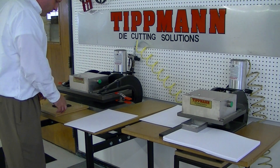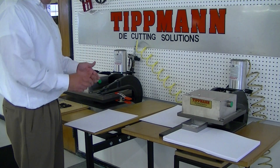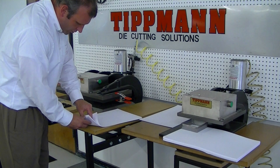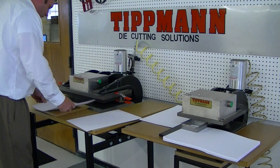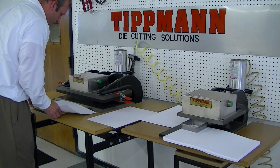The way this would work, you would design the die with the cavities to cut out from your printed material. I'm just going to cut about three or four sheets — you actually get a pretty decent cut with three or four sheets; I wouldn't do any thicker than that. You would align your paper and get your registration pins.